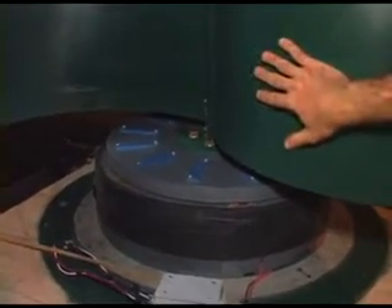The larger unit we're talking about installing is 14 feet in diameter, 8 feet tall, and it's magnetically levitated. There's a magnet underneath and another magnet on the base and it floats on a cushion like the Japanese magnetic train — we don't want any vibrations transmitting into the building. We want it to be very silent. I've got pictures of birds sitting on top of this thing riding it around in circles in a strong wind. This is a very safe unit — it won't make noise because it doesn't run fast. It produces a lot of power at a low rotational speed.